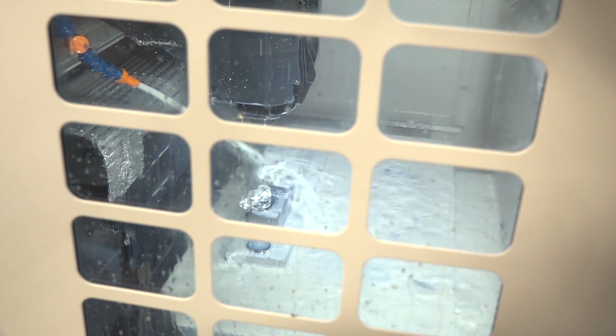Not only are you getting the part off quicker, not only are you getting a better surface finish — the surface finish that comes off these machines as a result of the big-plus spindle, the spindle face and taper, means you've got much better contact with the spindle, which means you've got maximum rigidity when looking for a better surface finish. And the fact you've got through-tool coolant as well means you do get a better surface finish. So you get a better surface finish, a more accurate component, a more economical machine that uses less power — it's a win-win all round.